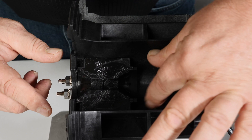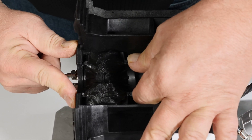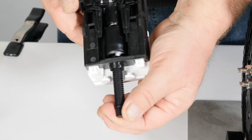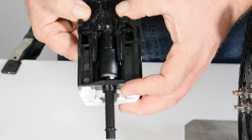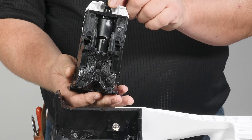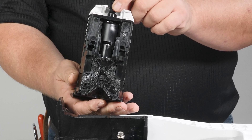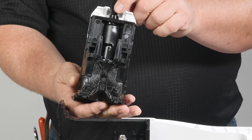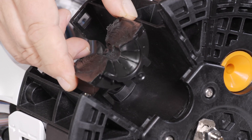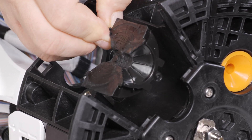Manually depress both sides of the base gel. Each time a sealing wedge is removed, manually ensure the gel compression screw is in the fully relaxed open position and extend the wedge sealing gel as shown. Set aside the sealing wedge in a clean, safe location. If the gel block is exposed to dirt or debris, simply rinse the gel with cold water to remove contaminants. If the base gel has been released from the base, simply replace it in the proper orientation with the locking tabs engaged in the bottom of the base.